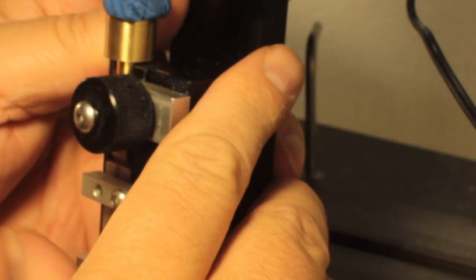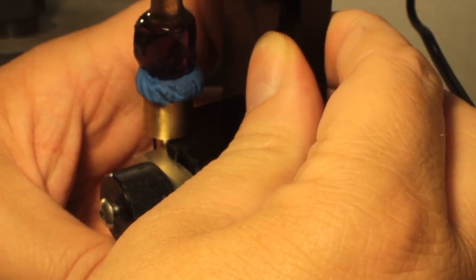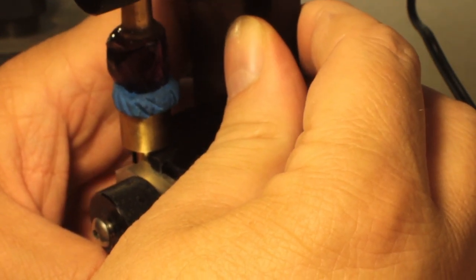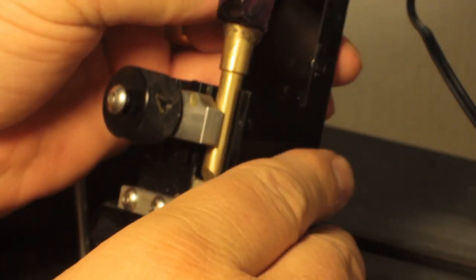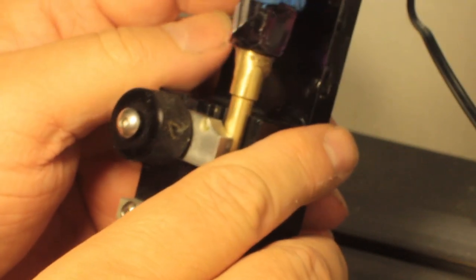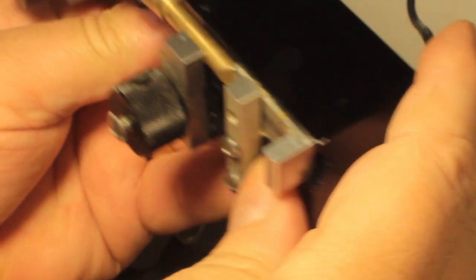It's not a big deal. Although if I'm cutting and I'm cutting into epoxy, I always worry that it may lose the grip. So I try not to. But the other thing is the epoxy gets into the laps, and it gums them up, and you have to clean them off. Not a big deal, cleaning with acetone, but I'd rather not deal with acetone if I didn't have to.